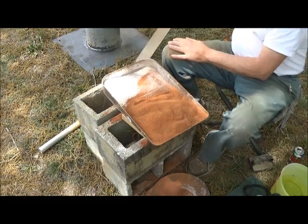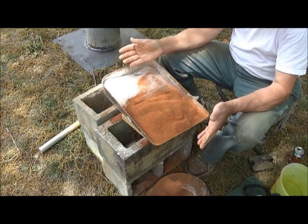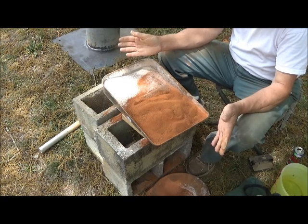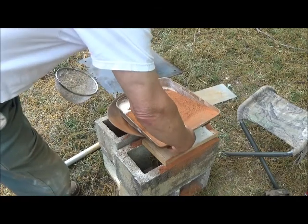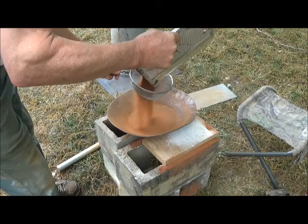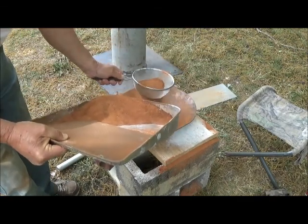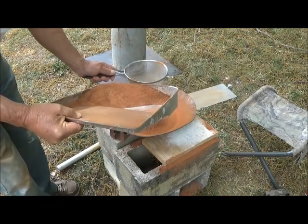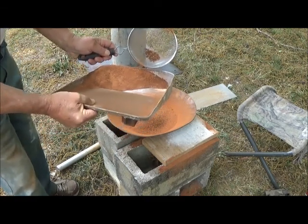But we're going to do one more thing before we add water. That is, we're actually going to sieve this to remove any of the larger particles and little bits of organic material and other impurities that have gotten into our clays. We've now got it ready for sieve. So we'll see how we do here. And if this looks like the ordinary kitchen sieve, that's exactly what it is, folks. Now you can see, yeah, we would not want that in our ceramic, so that's much too coarse.